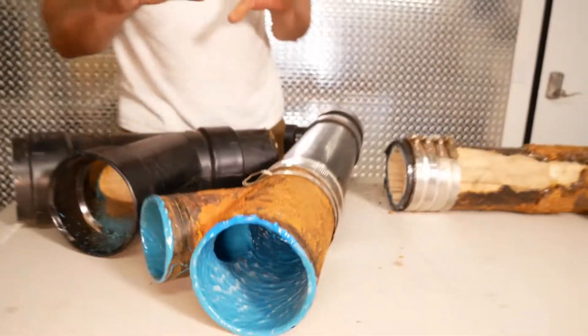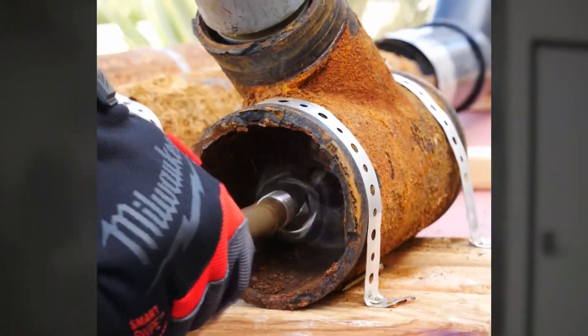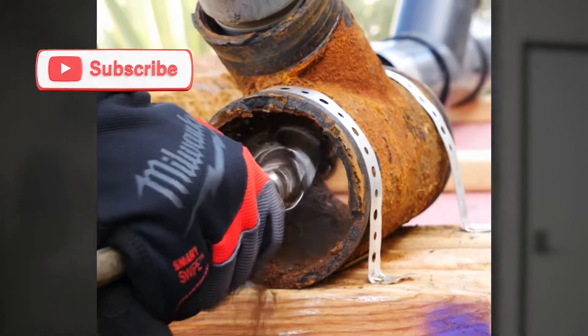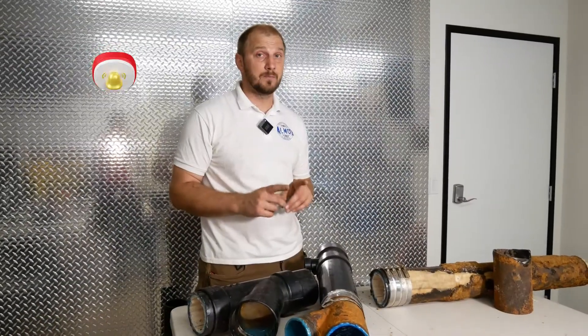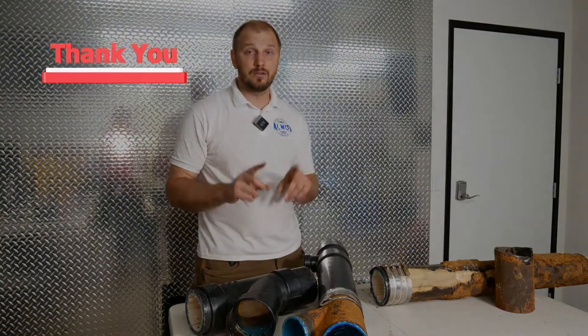The key of the work and performance is how the pipe is cleaned. 60-70% is preparation and cleaning the pipe, and the last 30-40% is the actual lining. Most of the work is cleaning and preparing the pipe. With cast iron it's actually harder — easier with clay pipe, but way more difficult with cast iron to make it work and run good.